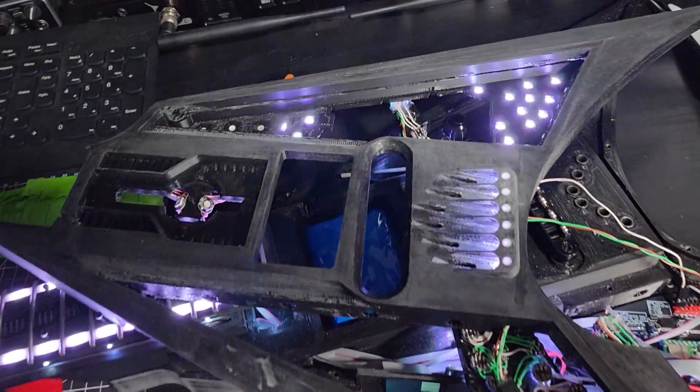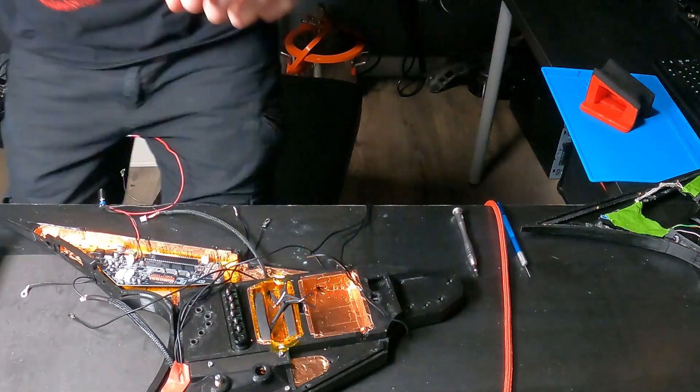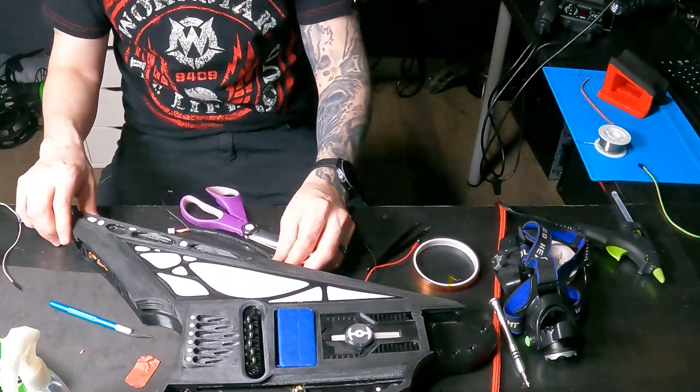You may be wondering why I'm looking for electromagnetic interference when I'm dealing with a circuit that is reacting to a signal within its own circuit. That is a really valid point — hindsight is 20-20 — but I was looking for EMI for a reason. Guitar pickups, it's not just a clever name: they want to pick up electromagnetic interference or signals all around them, especially if there's something pretty close to the pickup emitting a signal. I just so happen to have LEDs all around the guitar potentially generating this signal, plus the microcontroller and all the components on the circuit board — especially digital signals, which basically pulse constantly or at different rates. That pulsing is something that can be picked up audibly, depending on how you've got everything configured. So my theory was that all of these components around the pickups could be affecting it, and if we could shield them as much as possible, we would reduce the interference.